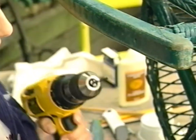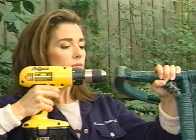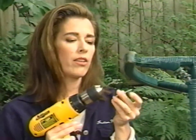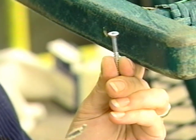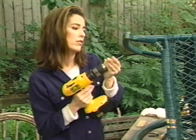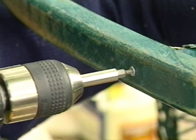I've chosen a drill bit size that matches the core of the screw I'm using so I can drill successfully. I went in up to where the screw starts to be sheer, and I think that should be deep enough. I can tell by the way the screw is spinning in the hole that this wood the leg is composed of is very porous and loose, so the screw isn't gripping terribly well — it's just spinning in the hole. I need to use a carpenter's trick to get that screw to hold better in the wood.